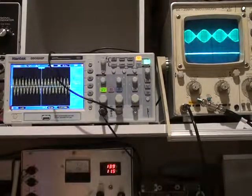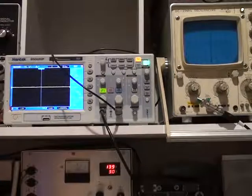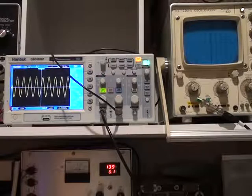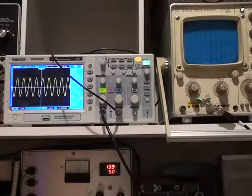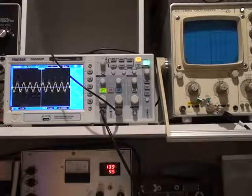A 20 meter band — we're clipping a little bit there, just over 100 watts. This is on 28.5 megs. The oscilloscope's upper limit is 25 megs but that's 100 watts on 10 meters, single tone. It actually goes higher than that — it can put out quite a lot of power. For some reason it seems to really like 28 megahertz: 10 watts, 100, 140 — I won't go any higher than that.